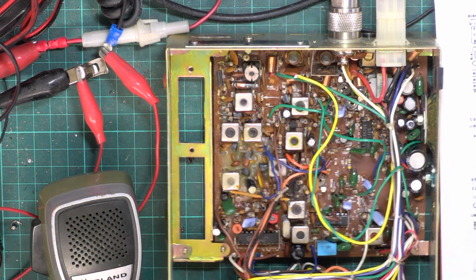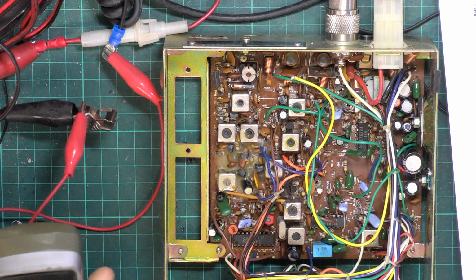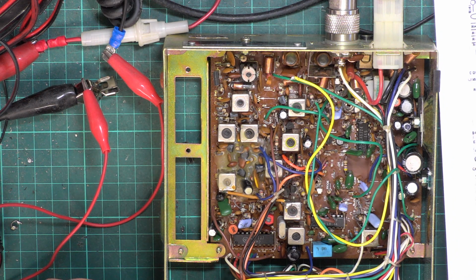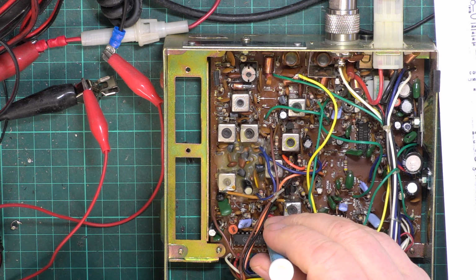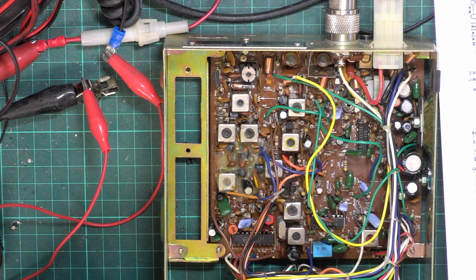So we'll go back to where we started, apart from when I just showed you an out of focus fuzzy meter. I'm going to transmit, so more or less on frequency. I'll show you that right now. In fact, we may as well trim that right now. We'll do that first. 27.79121 should be 27.79125. There we go. Spot on. That's one job done.